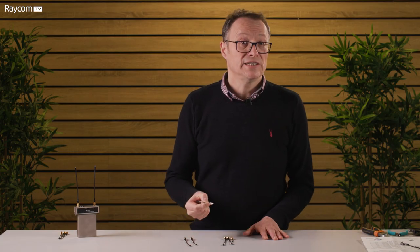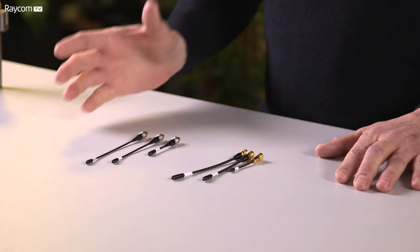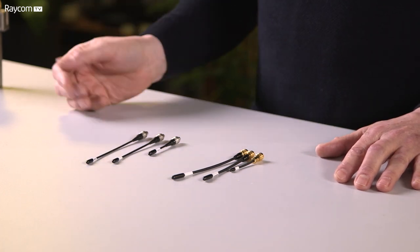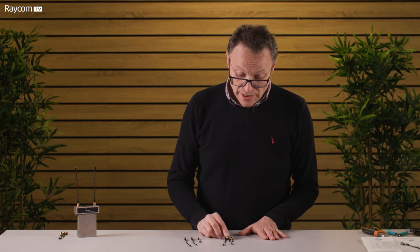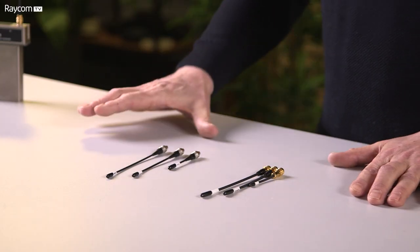Here, in the case of the DME antenna, it's very short indeed — very convenient for the talent when you're trying to hide a transmitter. So for optimum efficiency, the antenna selected must be for the correct frequency or block in use.